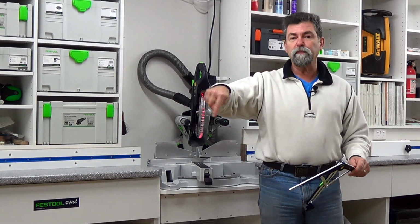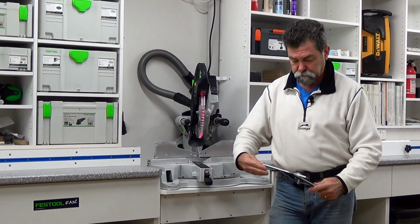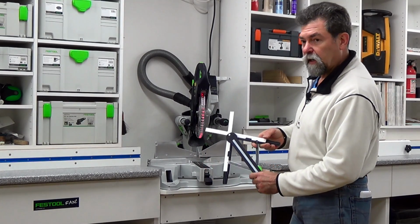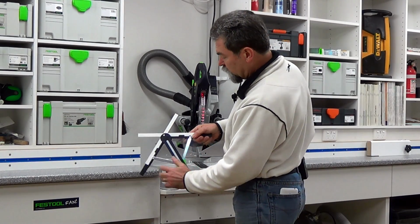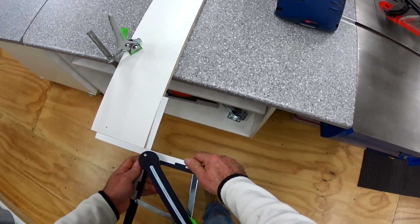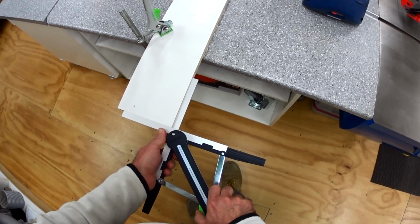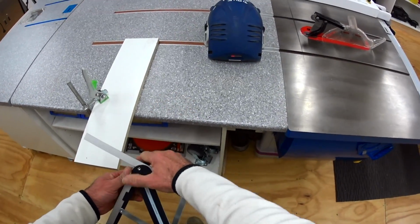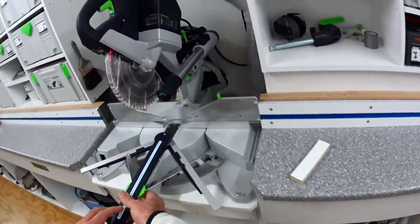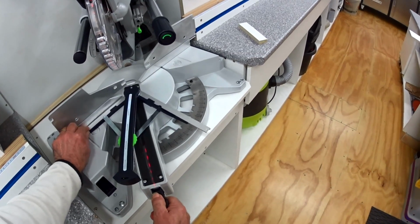It also allows me to check on a nib wall. So I'm doing baseboards around a nib wall in a house. I push it through the other side, like so. And maybe that camera's going to be better. So I can check it, and maybe it might be 90 degrees, it might be 87 degrees or something like that. I find out what the angle is by putting it up against wherever that nib wall is. Tighten this up, pull these back, and you know what? There's my angle bisection again, straight away. These things are fantastic.